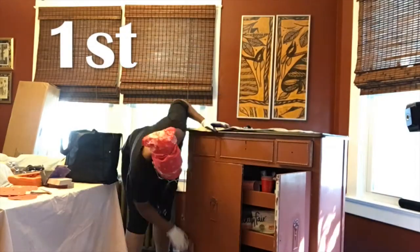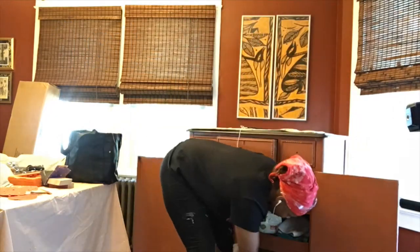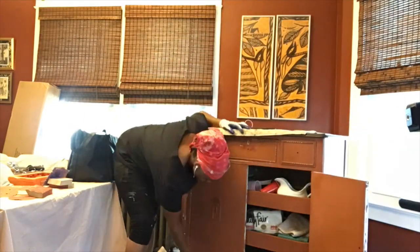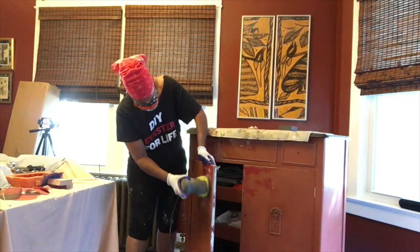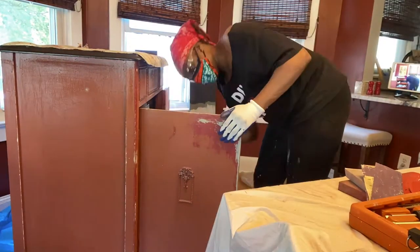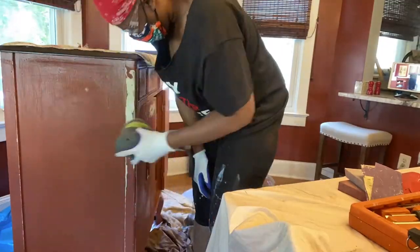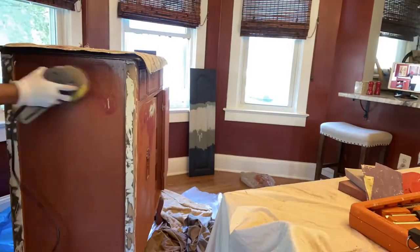The first thing you must do is sand your painted furniture. You really want to get the shiny or smooth surface really gritty. I used sanding pads followed by an electric sander — I'll put the links to those products in the description below. When choosing your sandpaper, make sure you use the lower grit papers first for the coarser roughening up, and then the higher numbers between 240 to 400 for that fine smooth finish.